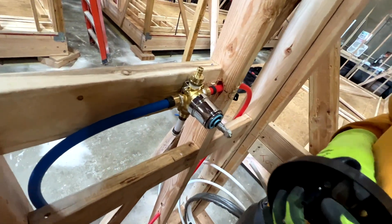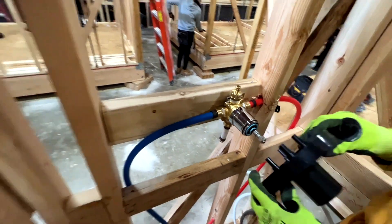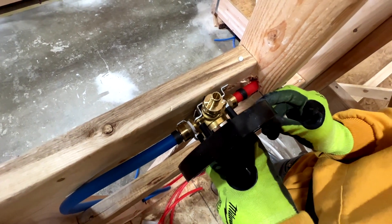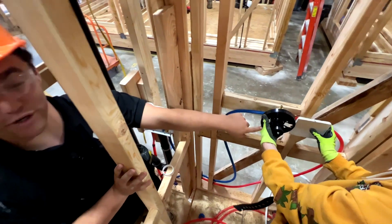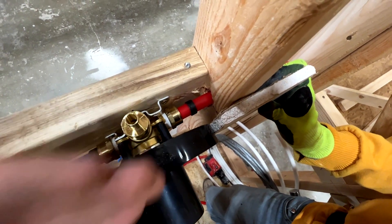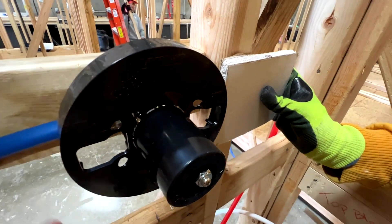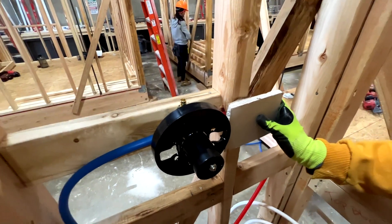It takes a while to apply Teflon tape properly to make sure you have a good bite so no water leaks out. Jasper is going to fasten it with a few drywall screws as well as the top plate, which will cover everything behind the scenes. He's holding a piece of drywall up to it — the valve needs to stick out about a quarter inch past the drywall, because once we tile, the tile needs to be even with the black plate. A finishing metal plate will go over the valve, so it'll all be flush with the tiling.